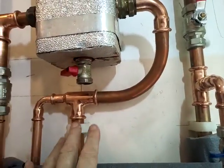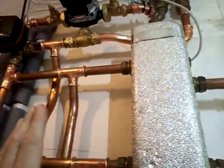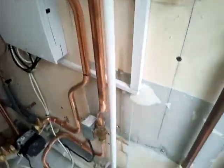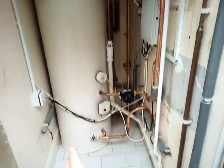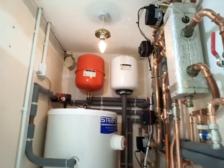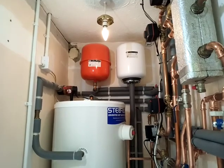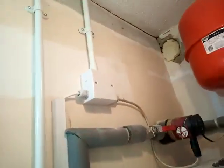This isn't the way I'd lay it out normally, but I had to fit the low loss header in here and squeeze everything into this tight little space. There's an accumulator that sits in the space here, connecting onto this union down here. It's all very tight. He's also got a Sonoff system for his secondary circulation pump.